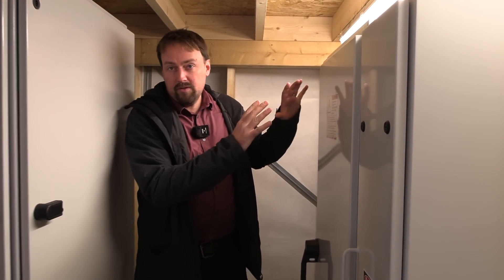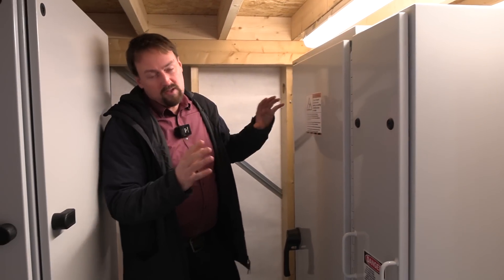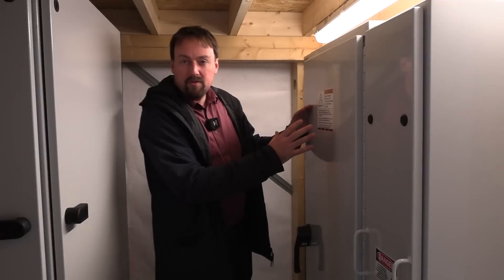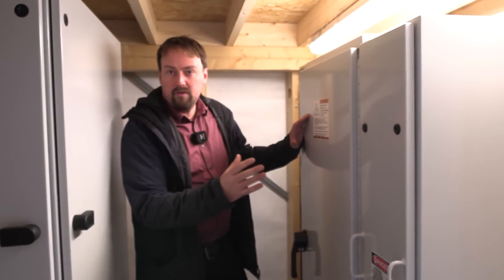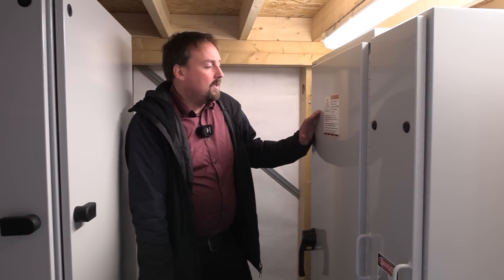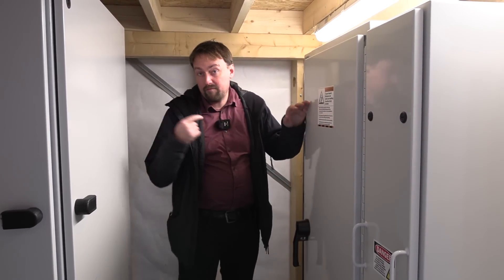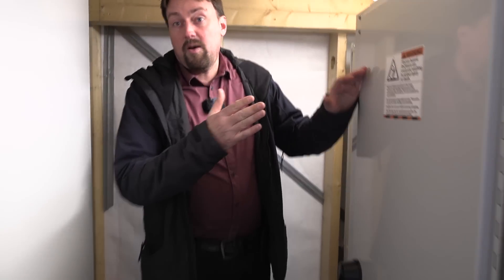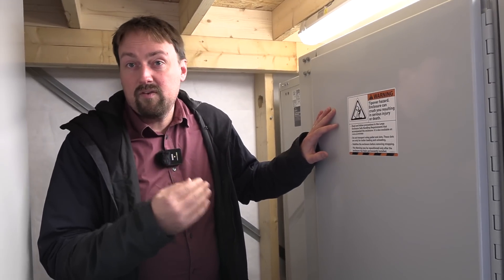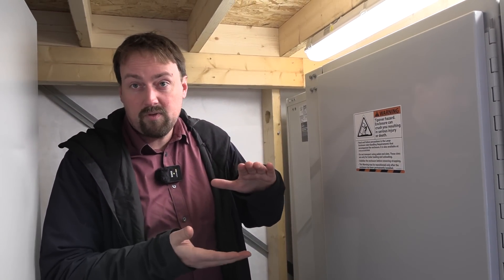We have a meter, power distribution in here, and an AC/DC converter so we can go up to 800 volts if needed, for a bus for example. Then we have an inverter that takes the 50 Hz AC up to 85 kilohertz AC — that's what we use to transfer power across the air gap at 85 kilohertz AC.